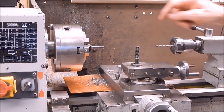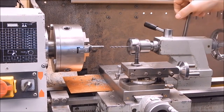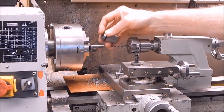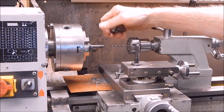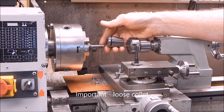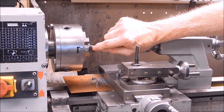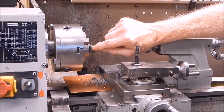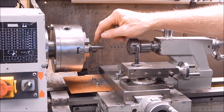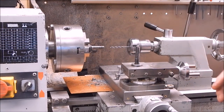So now I will take this out and put it in this collet, and we'll support this end with the collet. I could support it with a live center as well, but I'll support it with the collet as I've got the collet chuck going. Then I'll cross drill with the mighty little 775 cross drill into the gallery in three places. Measure it up, cut to length once again with the little cross drill, which can cut as well. Job done.